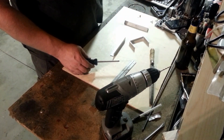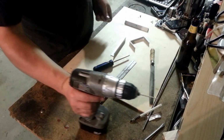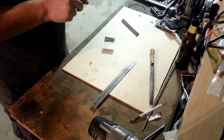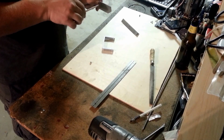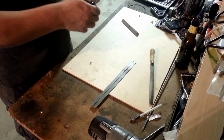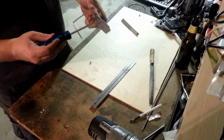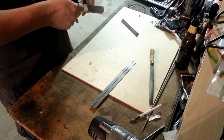Like I said, they're just computer case screws, coarse thread, Phillips screwdriver. You may be tempted to put a drill bit onto this and then try to put these in. Please don't do that. You're going to destroy the threads or the aluminum. It doesn't take much to overpower it. Enough to bite, but not so much that it's hard to screw in. And the reason I'm going in towards the outside is there's a lot more material on this bridge piece than there is here. So I want all my biting to be done on the thicker material there. There, that's good and solid.